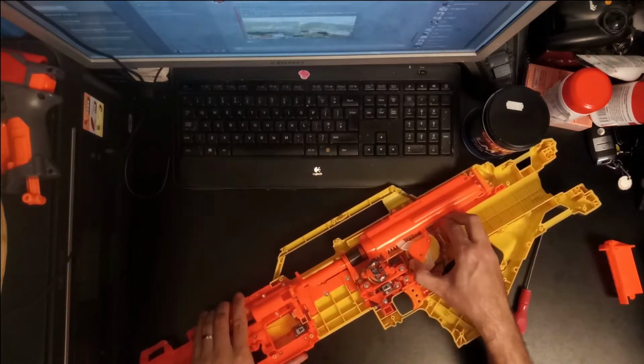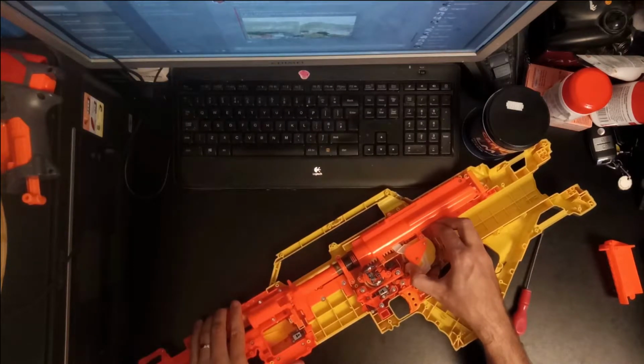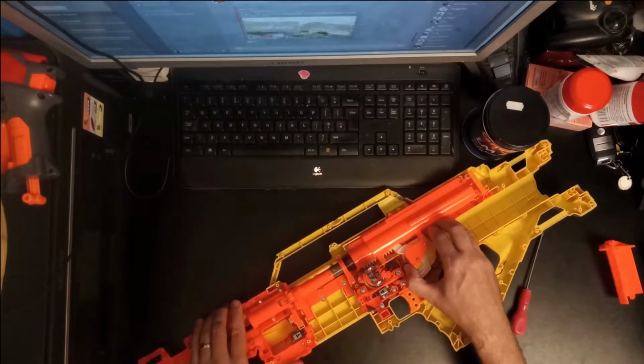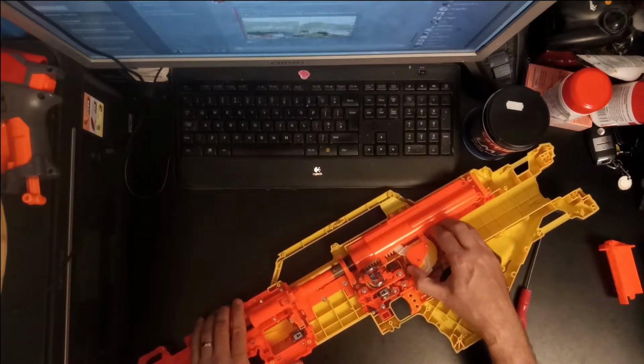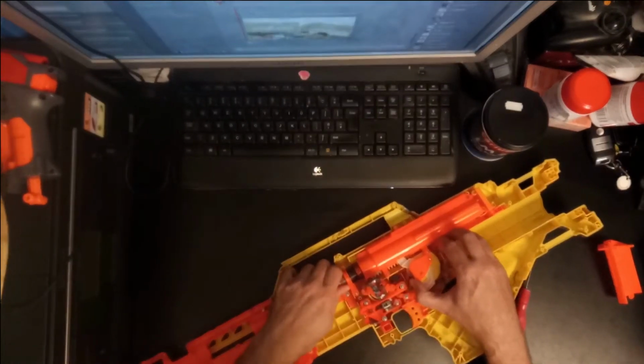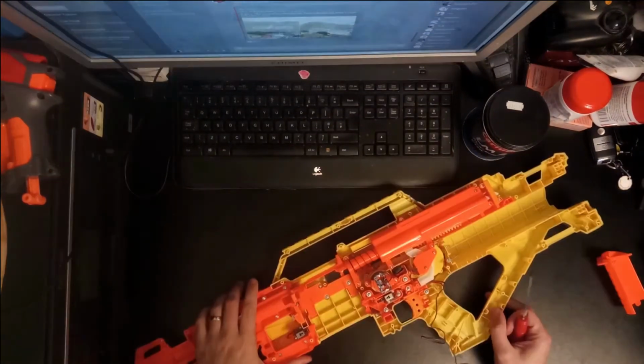When it gets to the front, there's mechanisms it interacts with. You'll hit that. Yep, and that's the spring releasing there. You can see, look, now a lot easier to move, and this spring here will push it backwards. But before I let it fully turn all the way back, you can see there the back of the plunger rod's disappeared out of the catch. And that's exactly how it works.